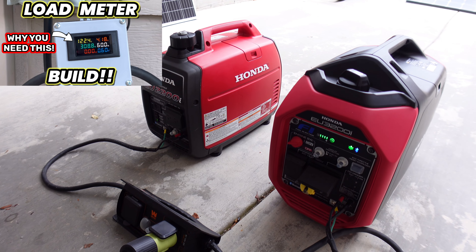We're going to go ahead and turn on another unit — we'll go to the front bedroom and turn on this AC unit. This one is a 13.5k and I also installed a soft start on this one. I'm going to turn on the fan first — you should just let the load slowly creep up on it — and then we'll turn it all the way on to the regular AC side on low fan. And we'll watch it kick up — there it goes.